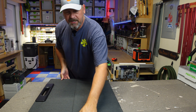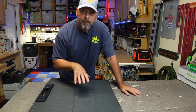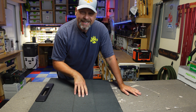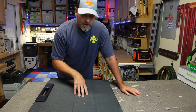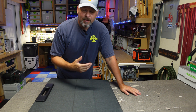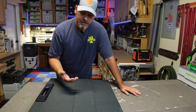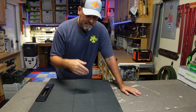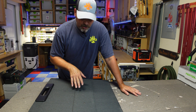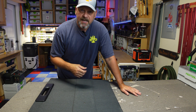I'm going to take this thing outside — enough of the specs, that's boring — let's see what we can pull out of the solar panel. It is already 90 degrees outside, and in case you don't know anything about solar panels: you might think that when it's hot and super sunny these are going to put off the most power. Well, that's not necessarily true — the hotter it is, the less efficient these solar panels are. So take the results with a grain of salt, but let's go outside and see what we can get.